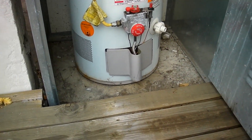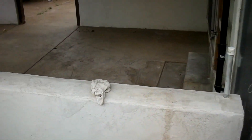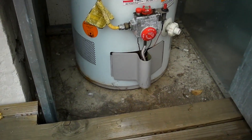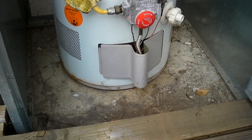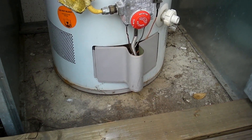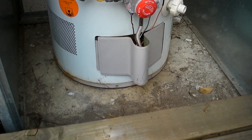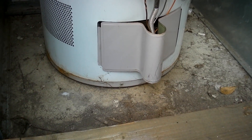As you can see, this water heater sits down below the deck level. There's a patio off to the left side of the water heater, and it sits down in a cubby hole. This is prone to moisture deterioration. The water heater itself should sit on a pad three inches above the surface grade, and you can see there is no pad installed under this water heater.